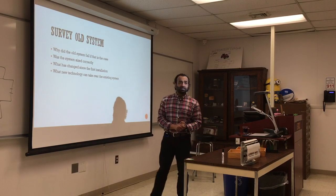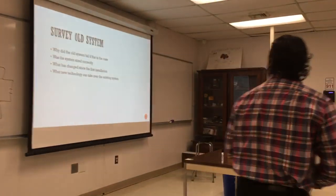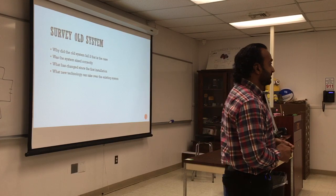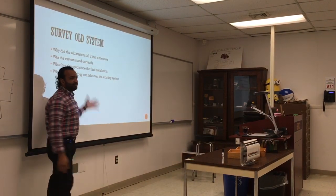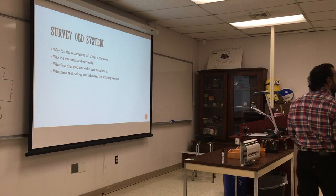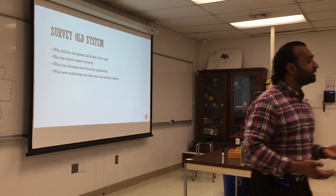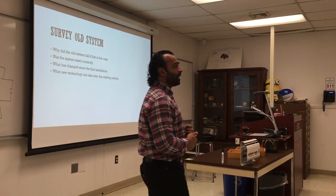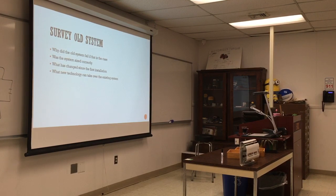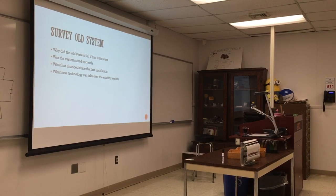When you go to a house because a boiler, furnace, or AC failed, first look at what size system is installed. But then ask: why did the system fail in the first place? Just replacing without knowing why is a big issue — the new unit might fail for the same reason. Always ask why. Why did the heat exchanger fail? Maybe there's the wrong setting, a chimney leak, or a transition problem. If the system served for 30 years, it could be old age, but metal fatigue over time is also normal.